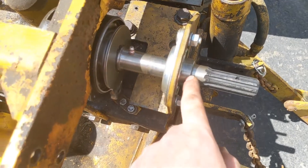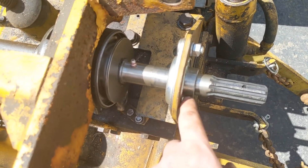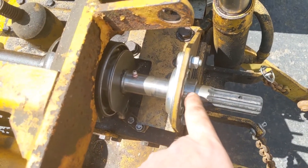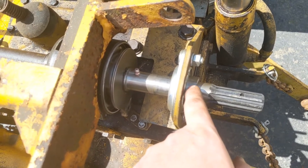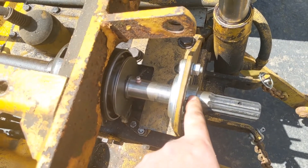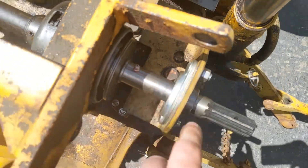Something to make note of: this flange here is actually part of the bearing — it goes all the way through. It has a couple of allen bolts on it and it's a lock ring, because nothing really holds the shaft from pulling straight out except for this lock ring, so you need to make sure it's tight. On the other clutch assembly this was on the inside — they shipped this with it on the outside. I don't see any reason why it's going to be any issue on the outside, and that's probably where the factory has it, but it does make getting to this bolt a whole lot easier so I'm just going to leave it.